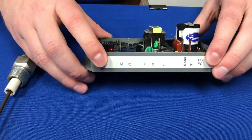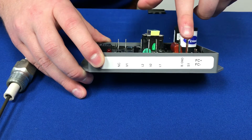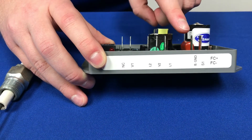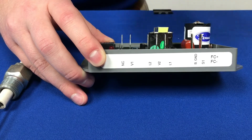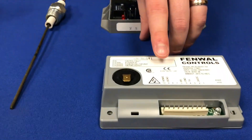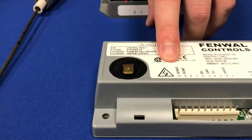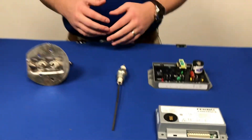It's important to make sure that the wiring is secure. Our flame sense signal wire on a 120-volt Fenwall board should land on the spade we see here — S1 — and there should be a ground wire from this spade, BE ground, from the board to a ground lug on the panel. Make sure that that wiring is secure. If you have a 24-volt ignition board from Fenwall, it'll be terminals 9 and 10: 10 being your sense wire, 9 being your ground.